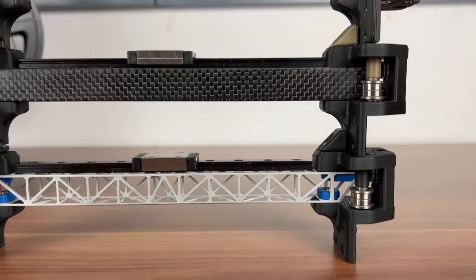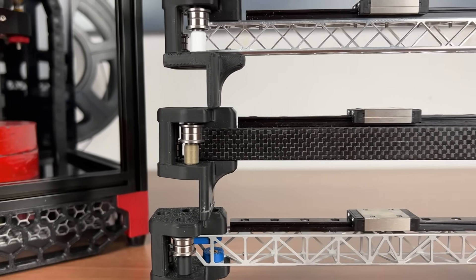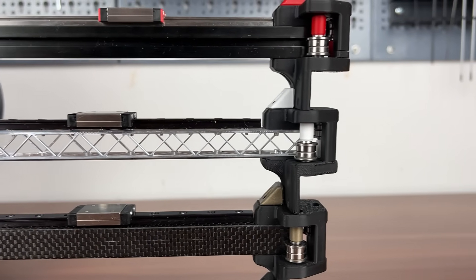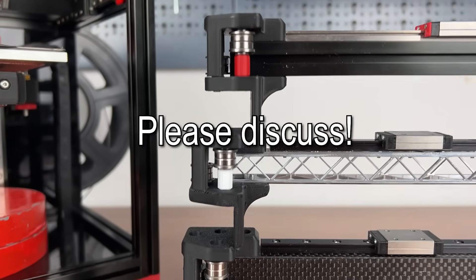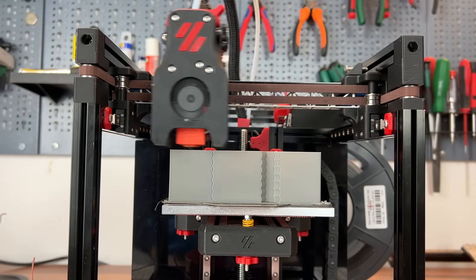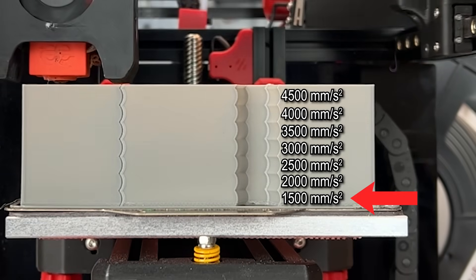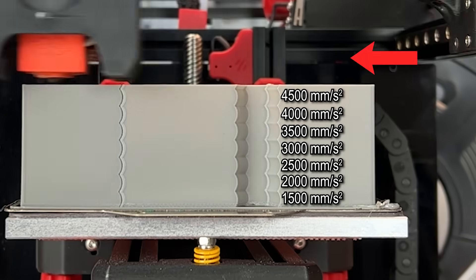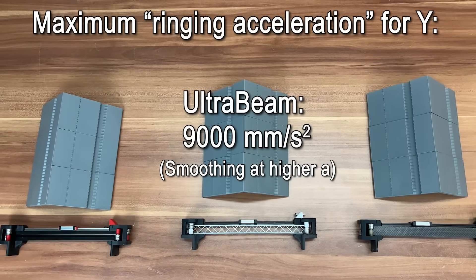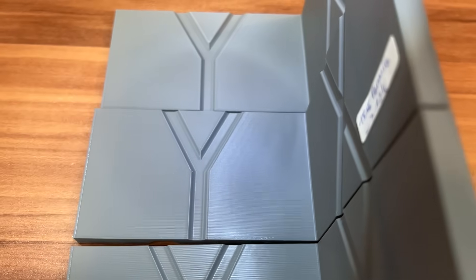That's interesting — I don't have a plausible clue why, as I expected a completely different result. Maybe the belt tensions aren't as equal as I thought, or there are tolerances and inaccuracies involved. Is the 1515 beam for some reason just slightly better than those lightweight beams? Please discuss in the comments. What counts are the maximum accelerations before ringing or smoothing starts. Using Klipper's Tuning Tower print with activated input shaping, incrementing acceleration by 500mm/s² for every 5mm from 1,500 up to 17,000mm/s², there is barely any difference between the beams. They're kind of equal in this respect.